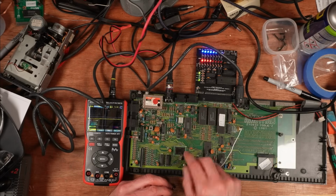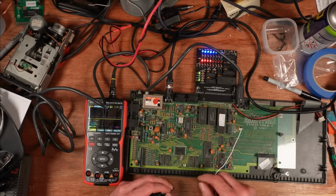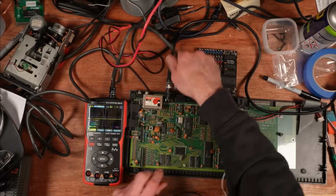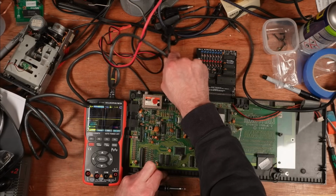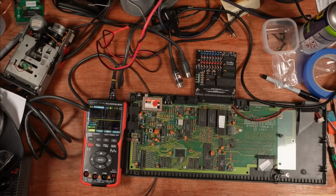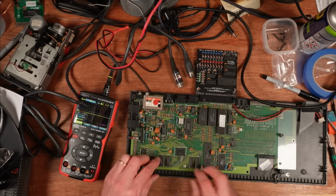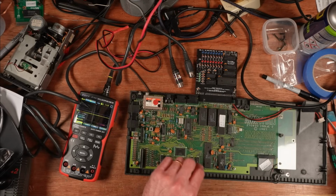On the other side of this, this ULA is soldered. It's kind of floating in the board, and these joints are quite prone to cracking because the whole thing is just flopping around in there. So I'm going to take the board out and have a look at the other side. And if not, I think I'm going to have to pop these chips out. I can't see which one is broken. It's indicating that chips 1, 2, 3 and 4, or data lines 1, 2, 3 and 4 are bad. So I'm not sure if that's really going to help me because they all look slightly bad.